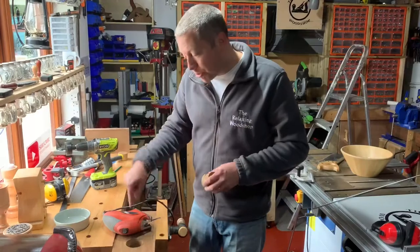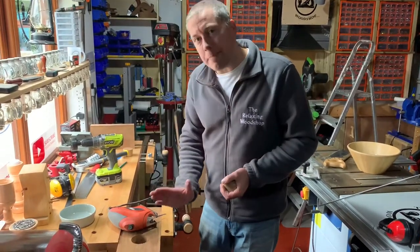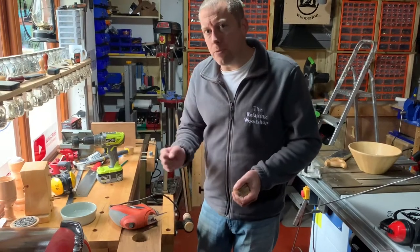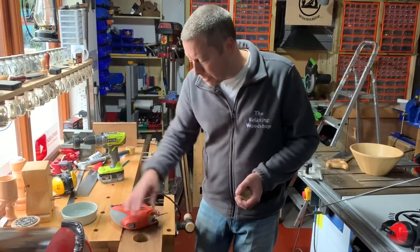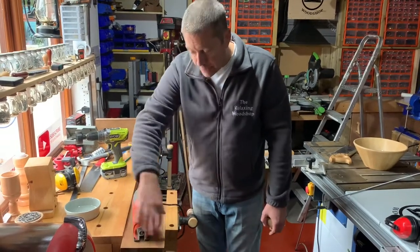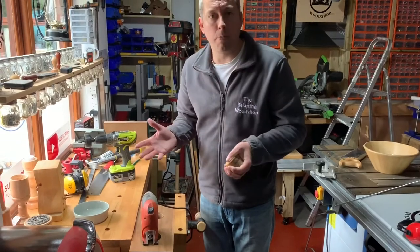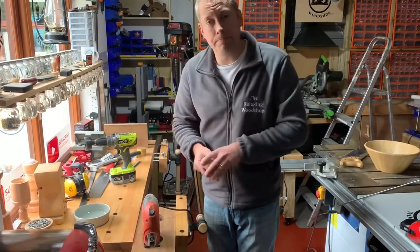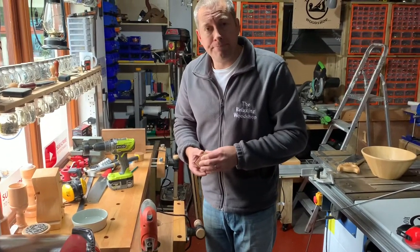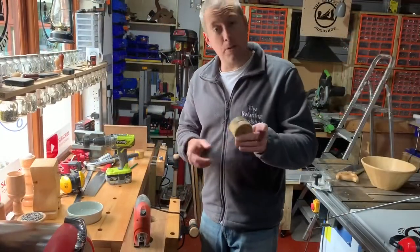Put a wee drill hole in a couple of places and work around it. I just want as maximum amount of room so I can creep up on that line and then do a wee router towards that. So that's why I wanted plenty of ample space, so when I get my jigsaw, I can go in there and then just work around it gently and make sure that it's as smooth as possible before we get the router, that I just said 20 seconds ago, router.